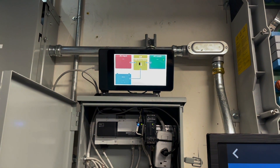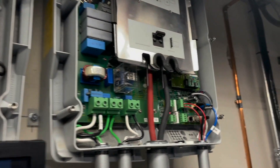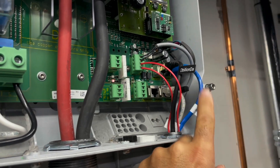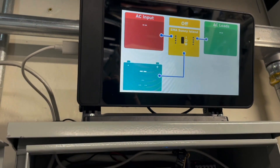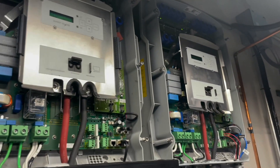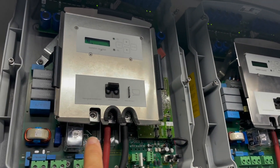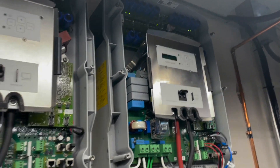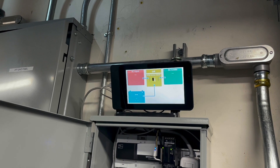Unfortunately I couldn't get this to work — there's some issue. I'm connected as I was to the Sunny Island inverter that was in the trailer, hooked up through the BMS side which is right here. This is CAN bus. But I am not getting data — the signal is showing but there's no data. I've already updated to the latest firmware in the Sunny Islands. I noticed that at boot this one on the right is at 1.004 and the one on the left is at 1.006. I may pull the inverter that's outside that I know works and put it back up here so I've got functioning data to see what the SMA inverters are outputting in real time.